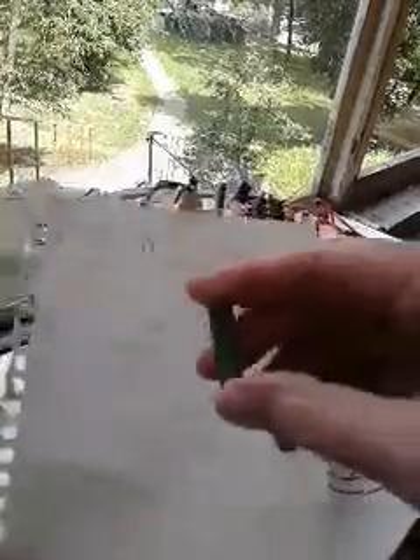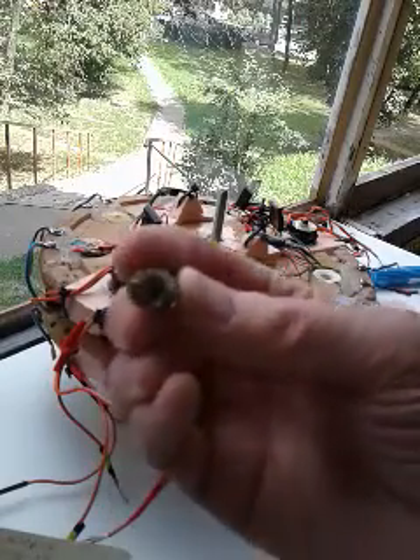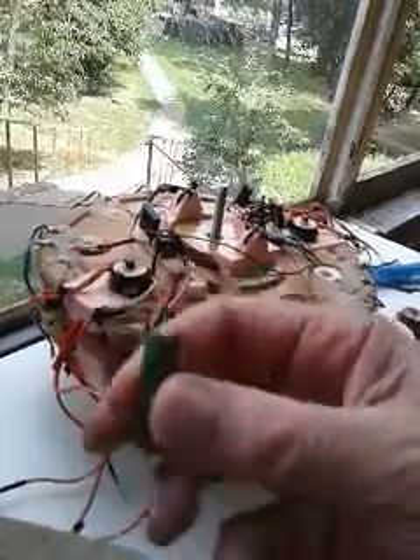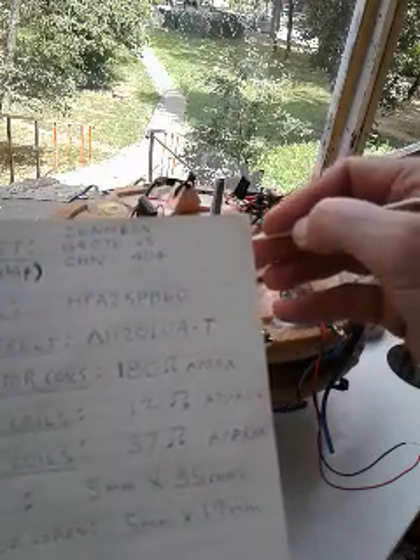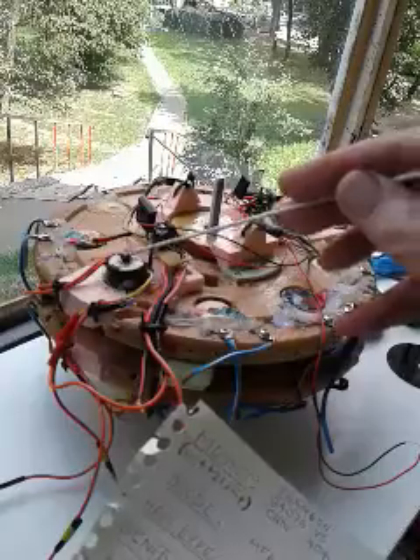The cores in the motor coils from top to bottom are 35 millimeters long and about 5 millimeters wide. They look like this — this one is a little bit thicker and not as long. I have florist wire strips as the core material, and inside is just some wood covered with epoxy. The motor coils are wound on sewing machine bobbins using Litz wire — I think 32 strands of very thin individually insulated wire. I have a total of three spools of Litz wire: one spool is for the motor coil, and the two behind it sharing the core are the pickup coils.